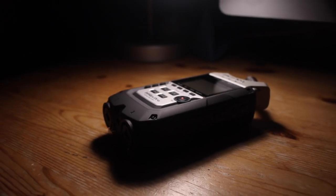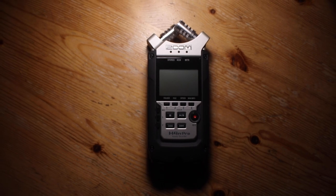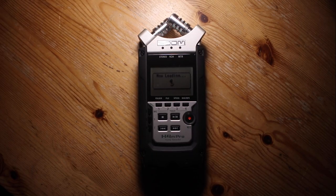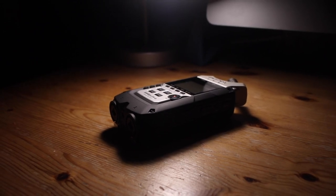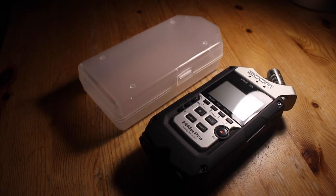If you're recording a stereo track at 24bit by 48kHz, 32GB should in theory allow you to record about 2000 minutes or 33 hours. Most SD cards should work, though I've included a list down below in the description that tells you which cards work with the Zoom H4n Pro officially. I've read reports that the startup time of the H4n Pro can increase if you're using a larger SD card — in fact, it took mine nearly a minute to start up with a 32GB SD card. Most people recommend using a smaller card if possible to cut down on startup time. That said, formatting the SD card whilst inside the H4n Pro does seem to cut down on the startup time significantly.